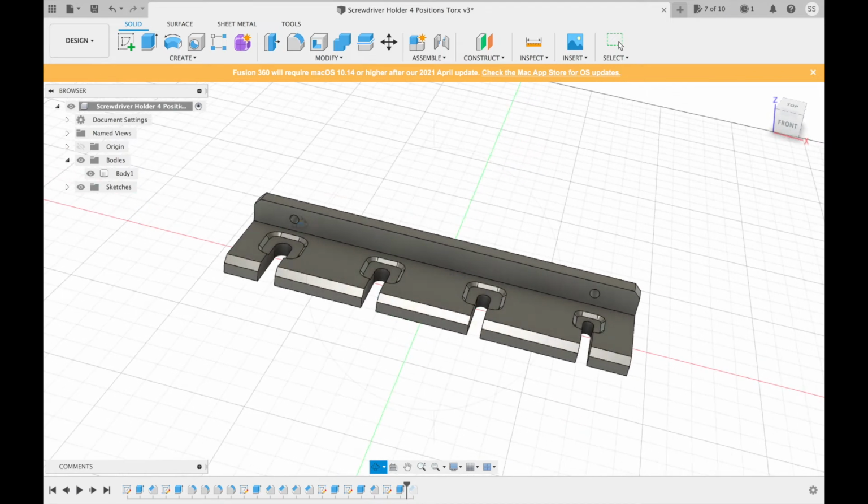And then I didn't want the screw heads to stick out and interfere with the screwdriver. I don't think they would have done, but on the larger one I was a little bit worried that perhaps the screwdriver wouldn't fit because the screw is in the way on the back. So I've recessed them in, and to do that we just literally add a chamfer to the circle, like that. So not really a tutorial on how you use Fusion 360, but just showing you the basic steps that I went through to create the shape.